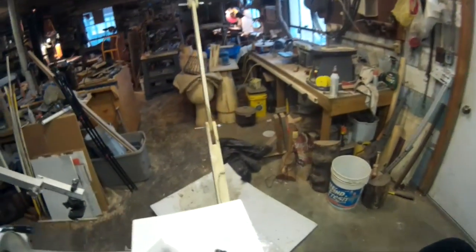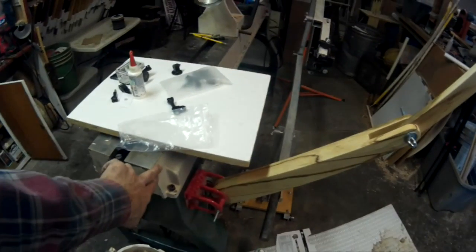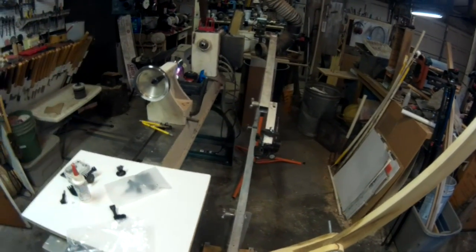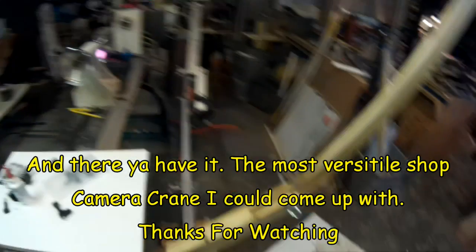So by the way, these can actually mount like this too, on the side of the lathe. And up, and I can actually mount that up on the edge of the bed, right above the work area, and it comes out and around far enough that it doesn't touch anything, even if I've got an 18-inch piece on there, maximum for this lathe. So, pretty cool.